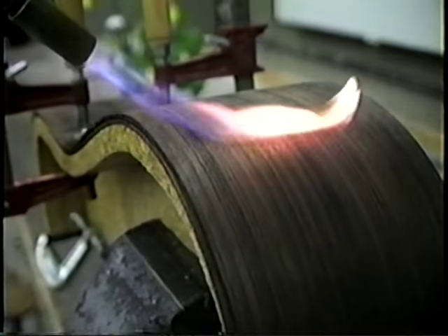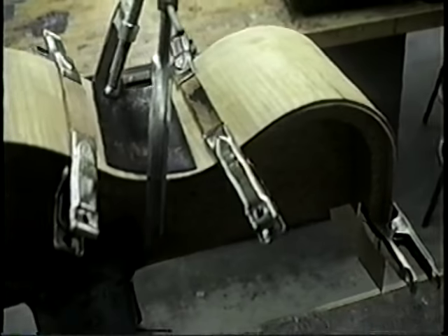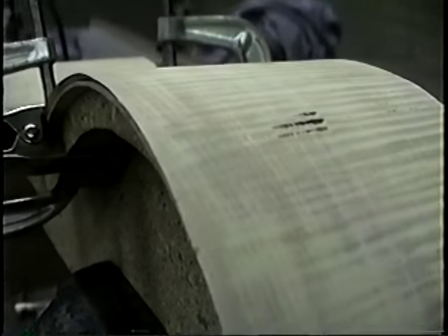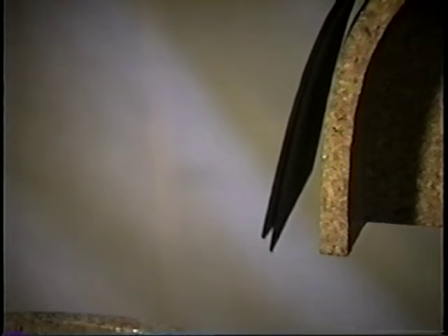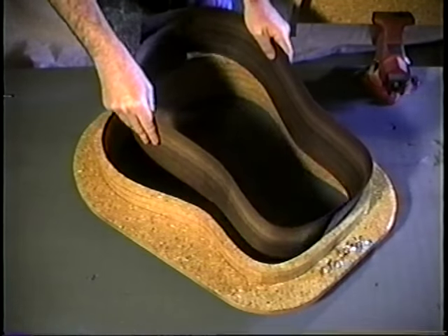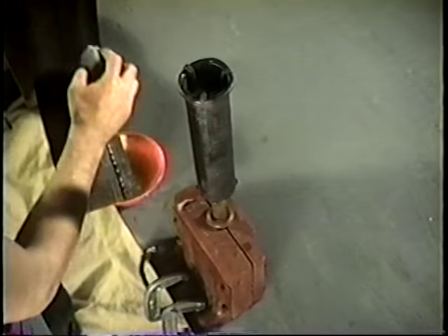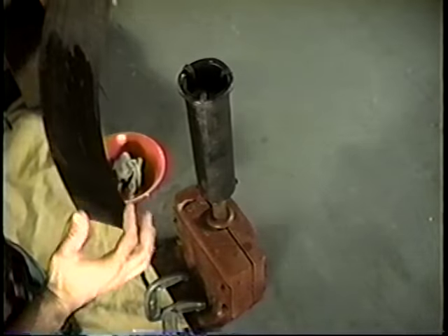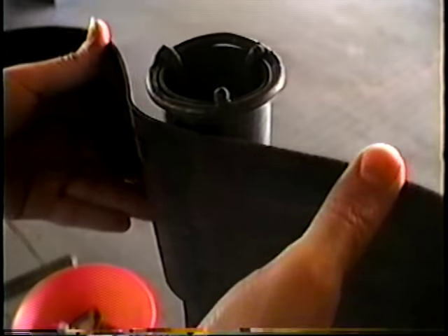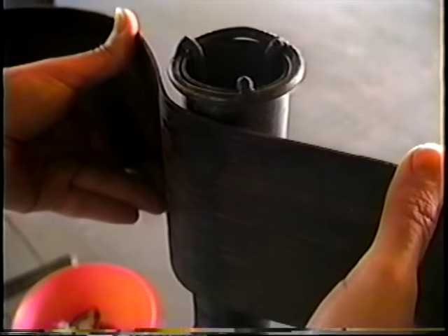Setting the torch for a large yellow flame and keeping it moving will prevent burning. Rosewood is relatively easy to bend using the boiling method, but some woods like curly maple tend to split and burn easily. The sides were dried for a few days on the bending form, then moved to the female form and clamped in place. For the classical guitar, we bent the sides by hand on a hot pipe mounted on a large soldering iron. The sides were wetted with a sponge just enough to prevent scorching. With firm pressure and a rocking motion, the sides slowly take shape — some experienced luthiers still prefer this method.